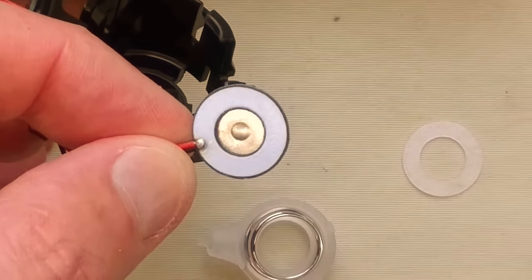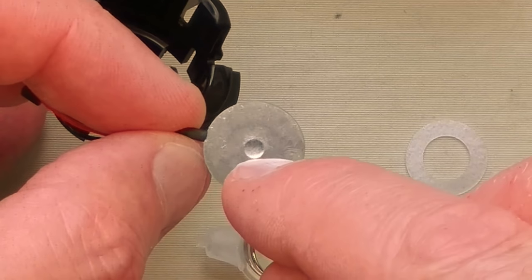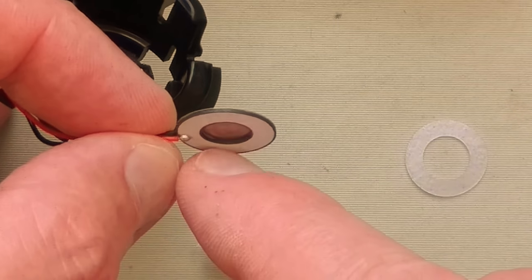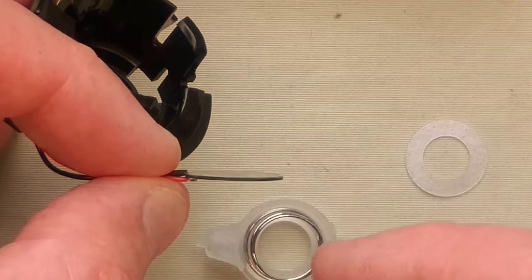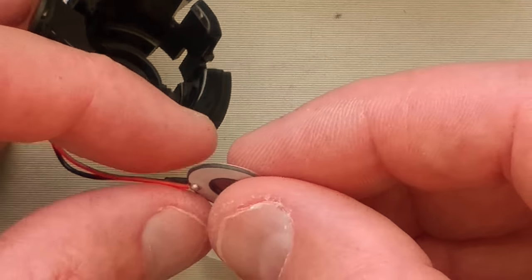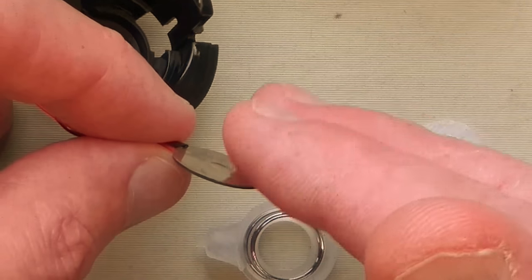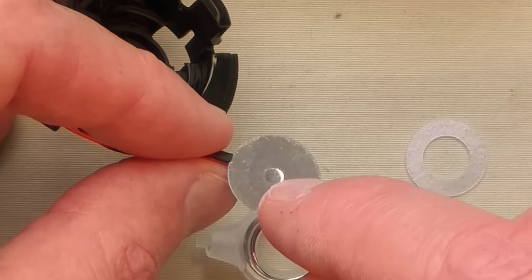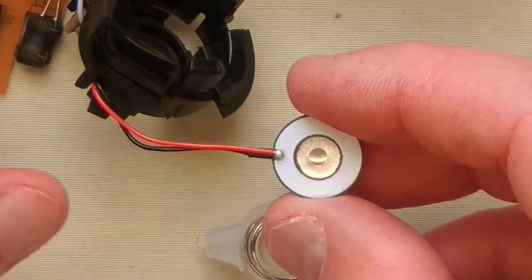At the risk of making the image a bit noisy, let's see if we can get a bit closer. The disc has a slight dome in it, and if you look underneath it through the microscope, it is peppered with a matrix of tiny, tiny little holes. This material here with the white top, which is covering an electrode, is a piezoelectric material — it's a crystal that when you apply a voltage across it actually changes in size; it basically expands and contracts. Because there's a spring pushing that down against the disc, it makes the disc resonate at very, very high frequency, and that basically pumps the air freshener liquid through and sprays it through tiny holes, atomizing it using that ultrasonic energy.